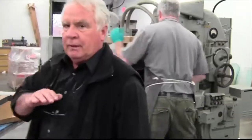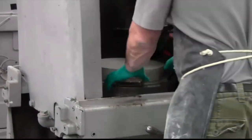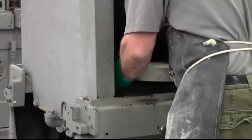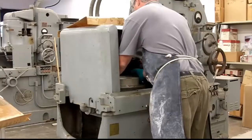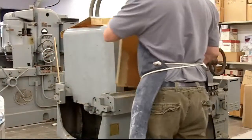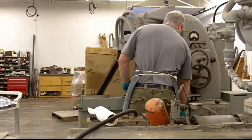Now we've got the bottom completely flat and parallel with the top surface, so now we can flip it over — that'll guarantee us that the surface we're grinding is going to be perfectly flat. In the final preparation of the font and its installation, we won't have a flat bottom. We're going to stopper it into the wood pedestal so that it'll appear as essentially a water source as compared to a water vessel. I wanted it to be continuous, fluid — that's probably the word I was looking for.